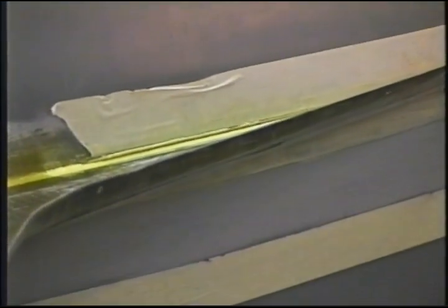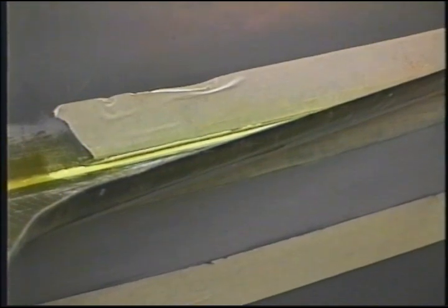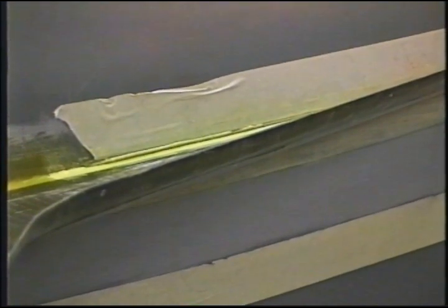And the forward section is just micro between the two, and that'll be cured tomorrow morning. We'll pull all those pins off the bottom side and pull the tape and do a 2-ply bid tape to the bottom side. See you tomorrow.